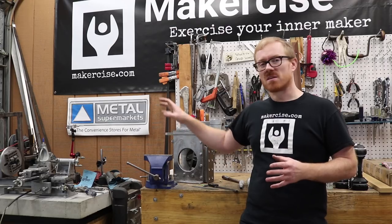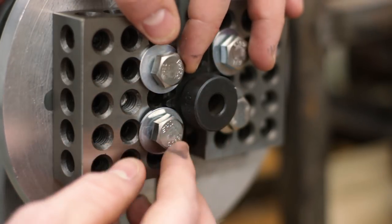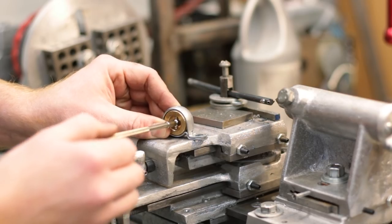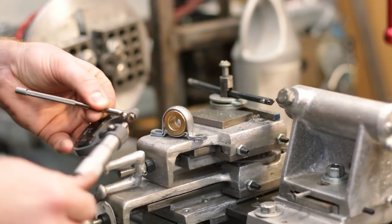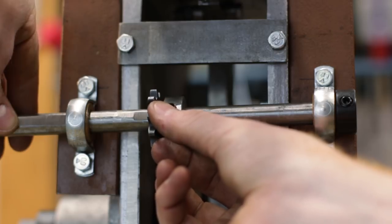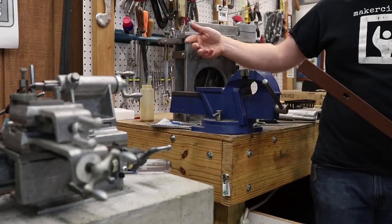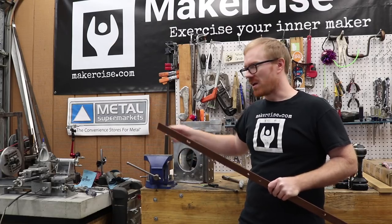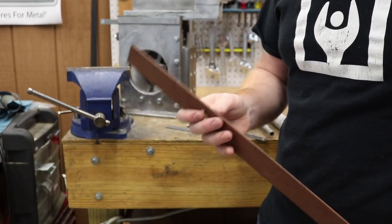To start this process, I'm going to fixture the pinion gear to the face plate, and that way I can bore it out. As I bought it, it's a 3/8 inch hole in the pinion gear, but what I need is a half inch hole, because that's what my bearings and pulleys are sized for, so I'll just need to enlarge that a little bit. Then I'll fabricate the mount for the pinion bearings, as well as the pinion shaft from this angle iron that my neighbor salvaged and gave to me.